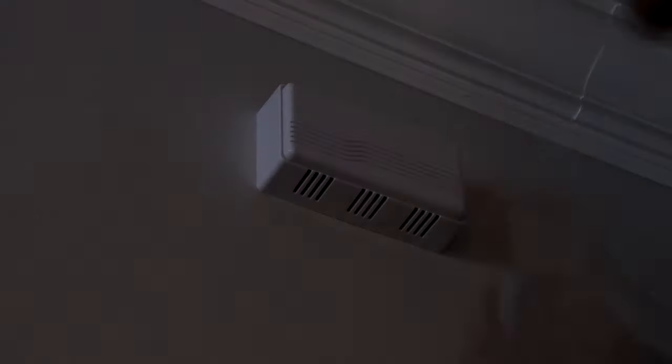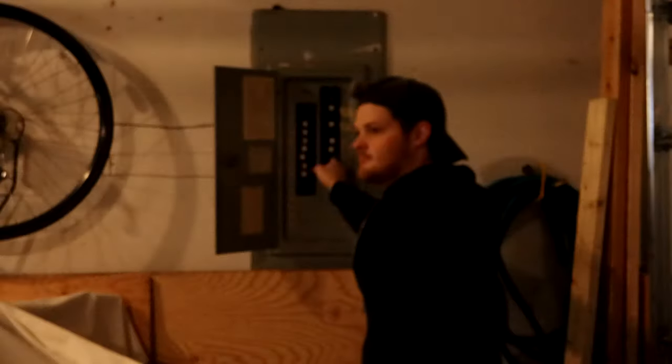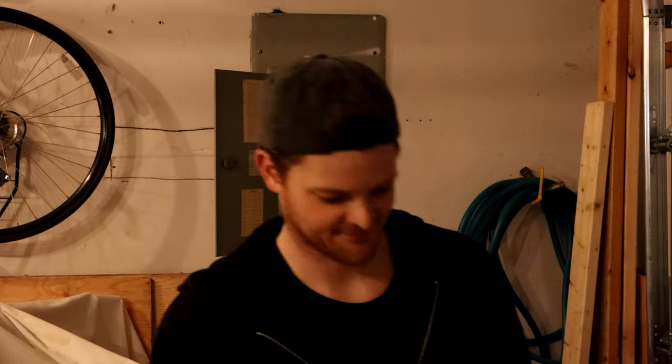Unfortunately, my file got corrupted and I can't show you guys me connecting the wires, but basically you're going to want to run the white wire from the doorbell pro to the front part that is labeled on the screw there, the front screw, and then you'll run the white from the transformer screw back to your transformer. It's pretty simple, guys. I'll link the diagram down below. Other than that, you're all done. Next part is to go find your breaker box, flip that breaker back on, give yourself a thumbs up. You've completed this job. Let's go test it out.